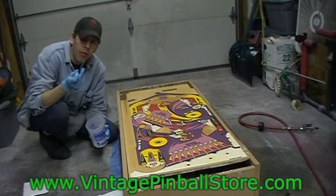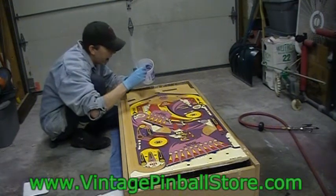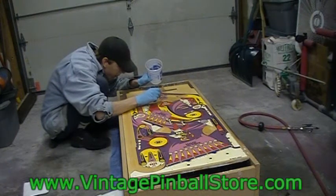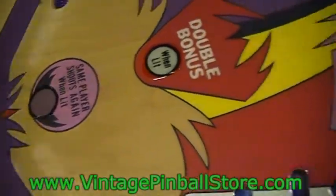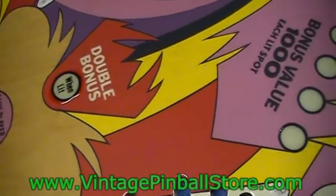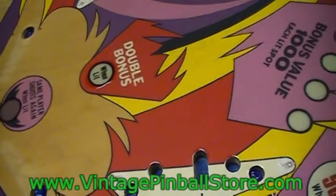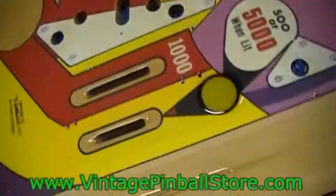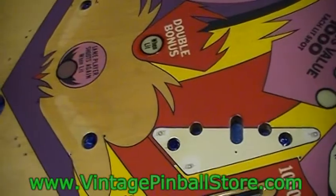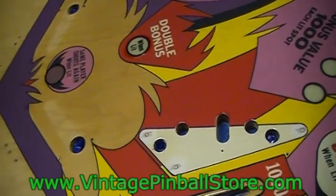To apply it I'm using a cheap 50-cent eyedropper from the supermarket. We're going to put some clear in it and carefully drop it onto the insert we want to level. You can see it looks a little gloppy, but the good thing is it's self-leveling - as long as your playfield is level it's going to find level. Once it dries we'll sand it down and it should be perfectly level. Then we'll let it dry a few hours, sand those down, and prep for the final two coats.